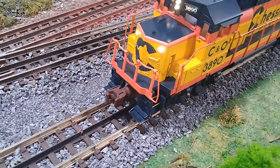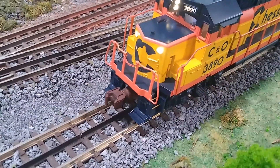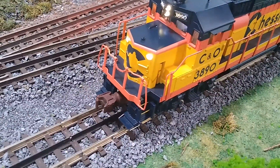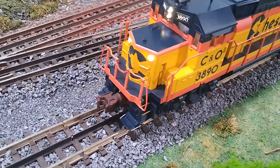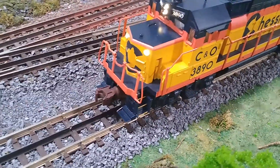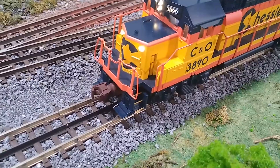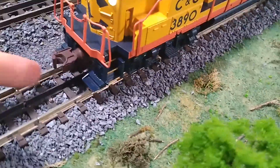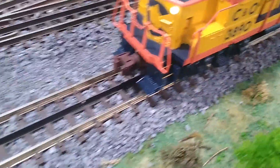I had to use the on-off one second in order to get that to work properly. If I just used the regular on-off, the board would go into overcurrent protection and kind of shut down on me. So I was using the on-off one second and it would work, but I would get this little vibration like you just heard.